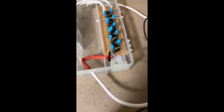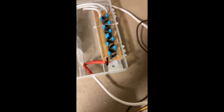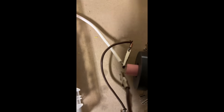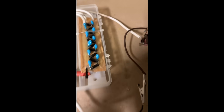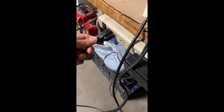We're going to turn it on. We're going to use a low power high voltage power supply which I built myself using a lamp power supply — this one's rated for about 12 watts — and a voltage multiplier. The positive output of the voltage multiplier goes to the metal casing of the magnetron and the negative or ground goes to the filament. I've got these two alligator clips to run the filament from a small transformer rated for 24 volts, but I'm using a variac to reduce the voltage to about five volts going to the filament.